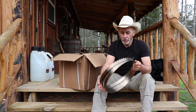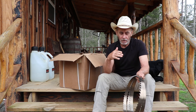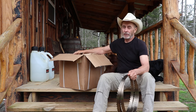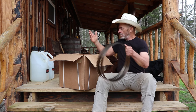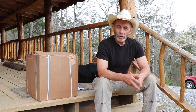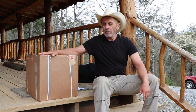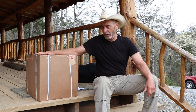He sent me two more with the teeth set at a little bit different pitch, so I could try to see if it cuts the wood differently. I told him mainly I'm cutting pine and poplar — if I was cutting hardwoods, we would be talking different specs. These other two blades are my normal width and gauge, and then he sent me eight of what I normally order. I was really impressed just by the courtesy he showed me over the phone. Before we even talked business, just kind of talking YouTube and channels. Nathan says Joe watches all of his videos, and I've been on live streams where Joe actually tuned in to Nathan's live stream.